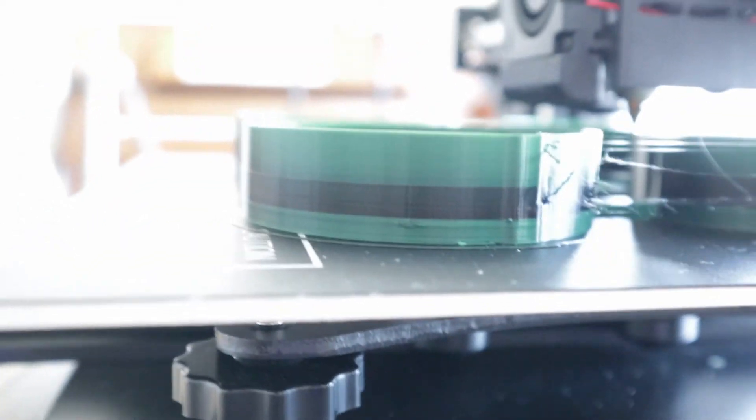Welcome back. I've been looking more and more at this print and I think I'm getting it figured out. I'm thinking the stuff on the left hand side is getting printed black and the stuff on the right hand side is printing green. I still don't know why it was starting the gradient earlier in the print, but it appears that the black is getting mixed on the left hand side of the nozzle and the green is coming in on the right hand side. Because the walls are so thin, that's where the color difference comes in - black on one side and more green on the other. For some reason it started out mixing, and then up to where I originally wanted the gradient to start, it starts. I was assuming the bottom part would be black as well. Well, it's not.